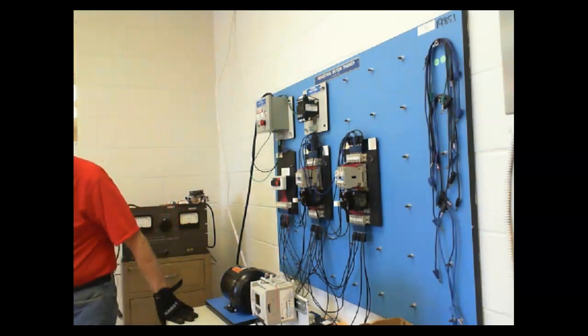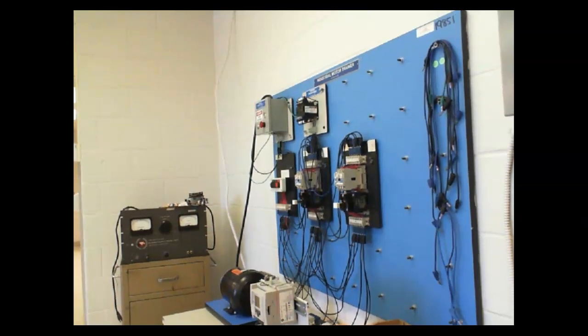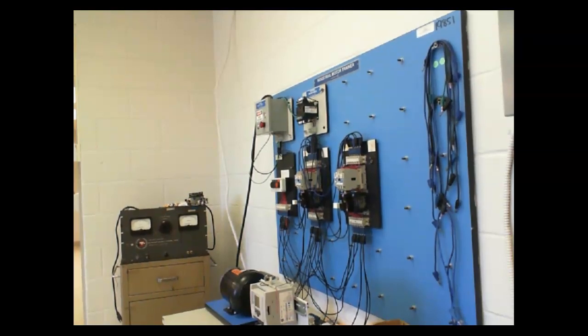So my retroreflective looks like it's at least a 10 feet range that we can set them up. This is what they have down at the bookstore. Used to anyways. But diffuse is a very limited range, right? Because it's dependent on reflective light. Retroreflective, though, we have a lot longer range because it's reflecting not from an object, it's reflecting from a retroreflector.